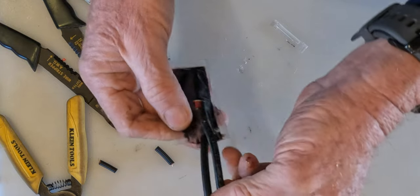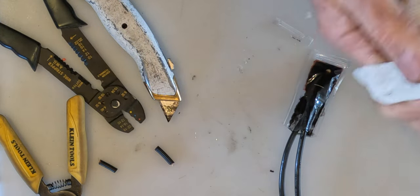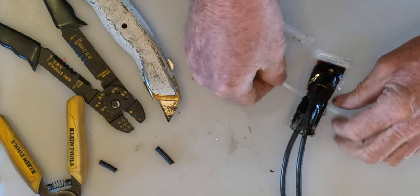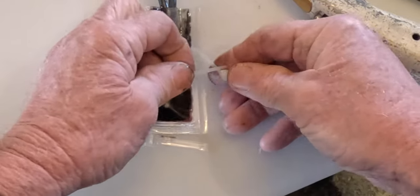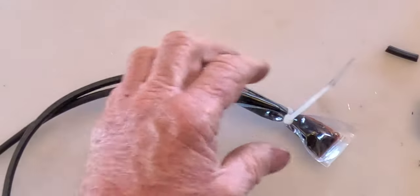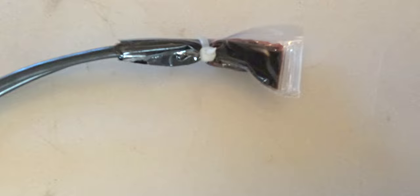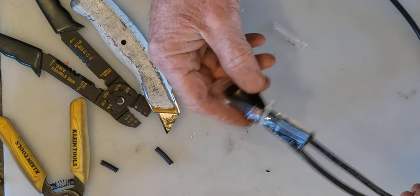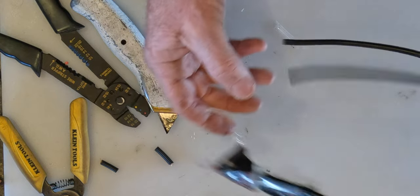Push it all the way down to the bottom and put a wire tie on there — don't let it slide away on you. Now that's good to bury. It's a little bit pricey but if you're doing a quality job you've got to spend the money and do it right. That is a resin seal on a connection. We do this too on in-ground boxes for pole lights and things like that — we always use these resin seals.